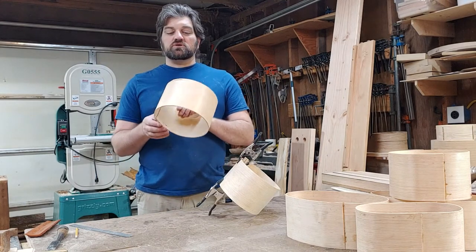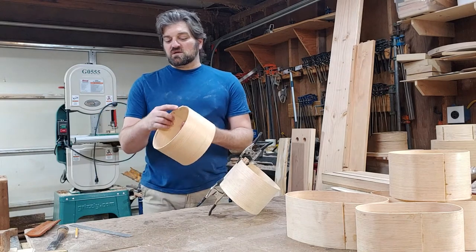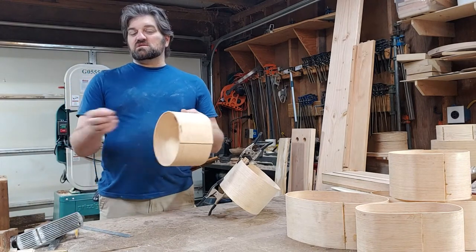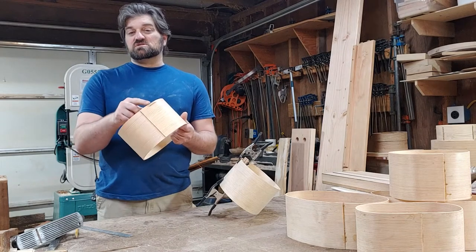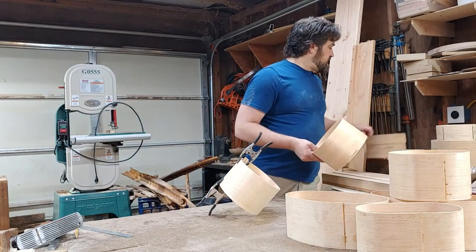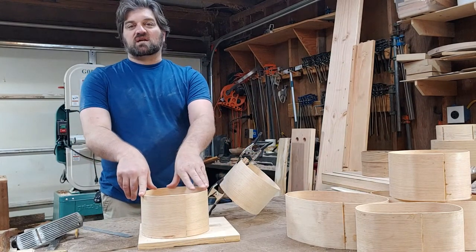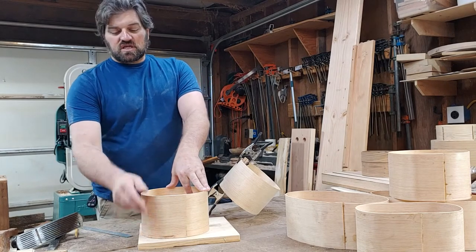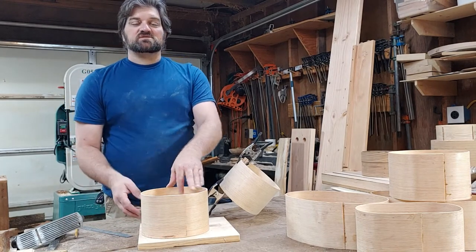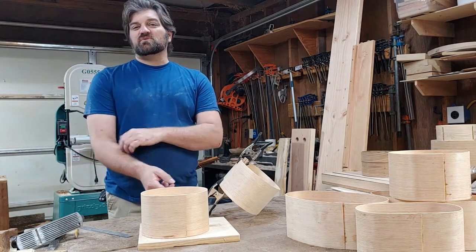For the ones that are glued, I've got a couple of steps next. I'm going to check them and make sure they're flat — this one is not, so I'll take a hand plane and work my way around until I get it flat. Sometimes it expands a little unevenly, or in this case the sap is sticking up and there's also a little bit of glue. Once that's flat, I'll take a flat board that I'm going to use to make my base, trace it out to the exact shape, then cut a groove around it so it's partly inside but also flush with the outside — a nice strong joint that's aesthetically better.